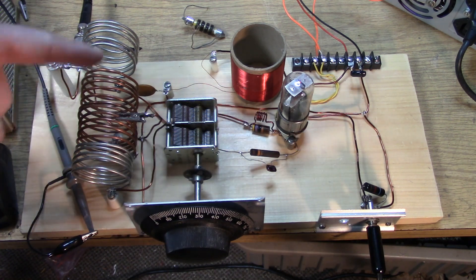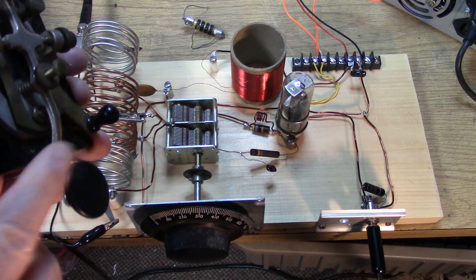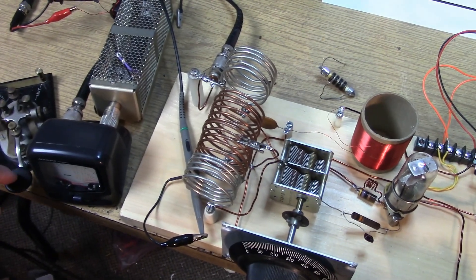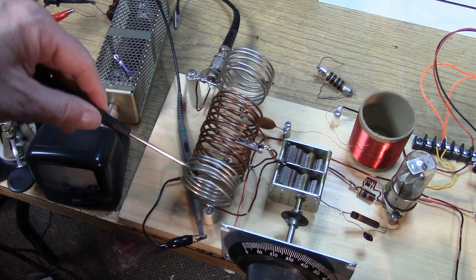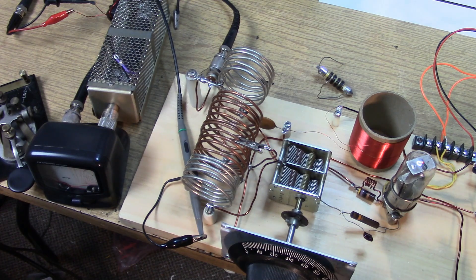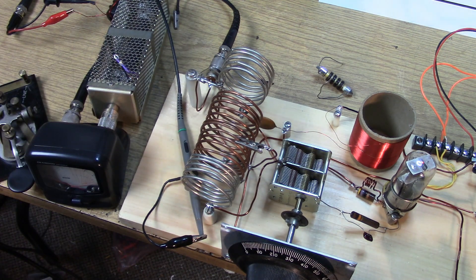Right now I have no fixed capacitor in the tuned circuit, and as you key on the table you'll get some wobulation. If I'm keying in my hand it sounds good, but when I'm on the table keying, you want to isolate all vibrations. There are three points on this coil where I have stability: the end, the middle, and the other end of the coil. With this number 10 wire it doesn't give you a lot of stability — that's another reason why we like to use tubing. The tubing would be more stable than this number 10 wire. Grandpa actually used copper strap a lot of the time, and copper strap is even more stable than tubing or wire.